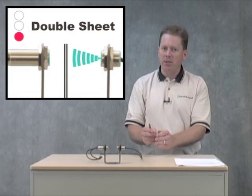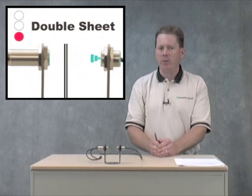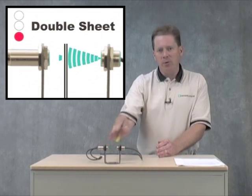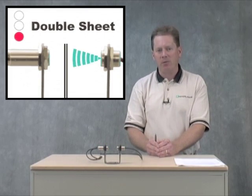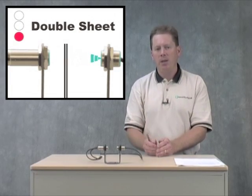If you have a double sheet, it will cut another 16% of that sound away, so you really have only 4% of the sound remaining. The receiver unit knows that you have 4% of the sound remaining, identifies the double sheet condition, your output fires, and the LED fires.